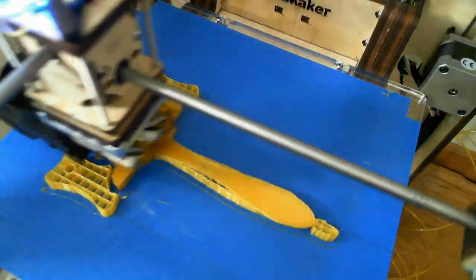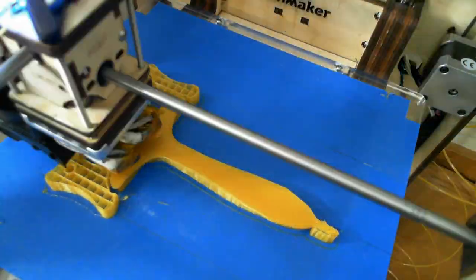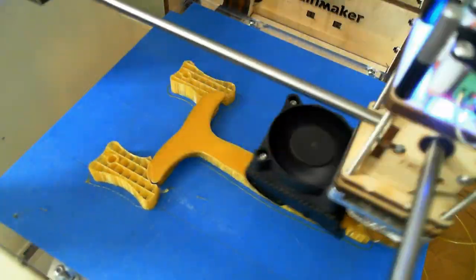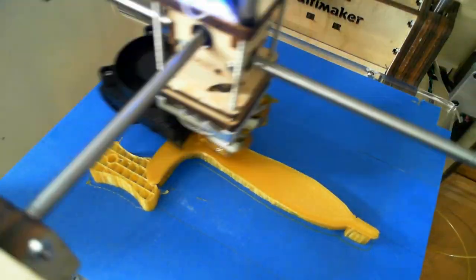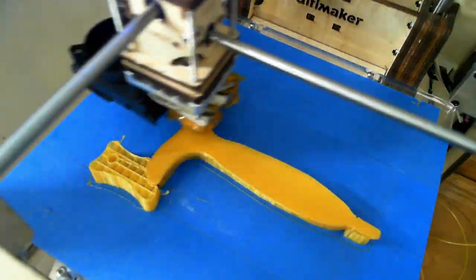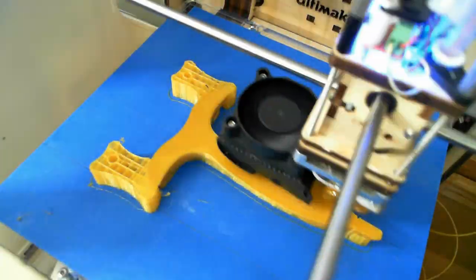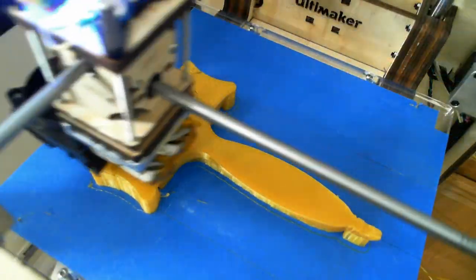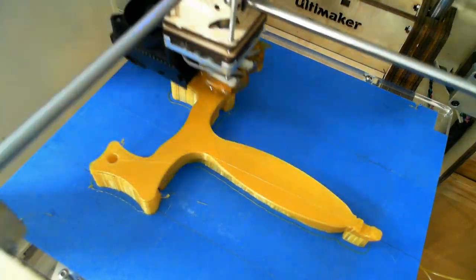You can see each one of the layers being built up one by one. It's actually fascinating to watch — it sounds like R2-D2 all day long in the man cave. The material I'm using here is gold PLA-PHA that I received from PrintedSolid.com, manufactured by a company called ColorFab. It has a melting point of about 190°C all the way up to 220°C. I'm printing at 220°C because I want it to be really melted and really well bonded since this is going to take a lot of stress — we're actually using this thing as a weapon. You can see the little support structures it's built up. It's printing over the top of them, mainly towards the base near the lanyard attachment. It makes it really easy to break them away, and it's not a huge waste of material. Without that, you'd be unable to print a form like this — the material would just drain out of the print head and fall down. So support material is absolutely necessary if you're printing any objects that have overhangs.